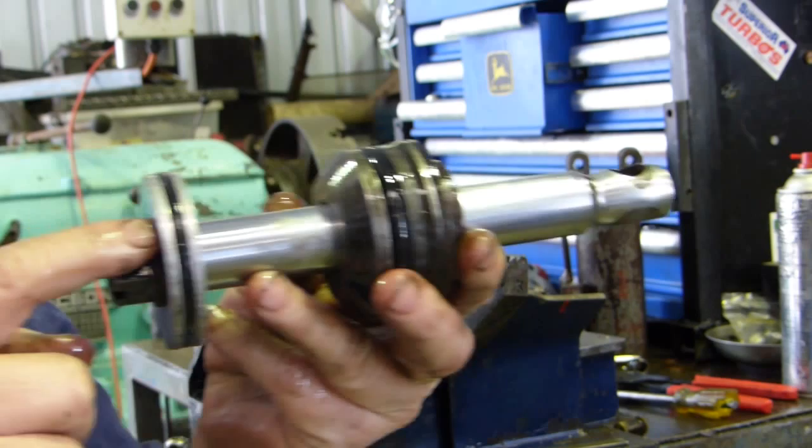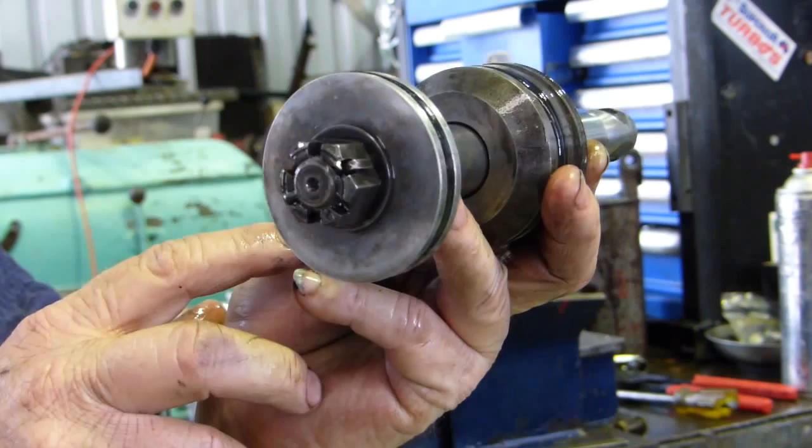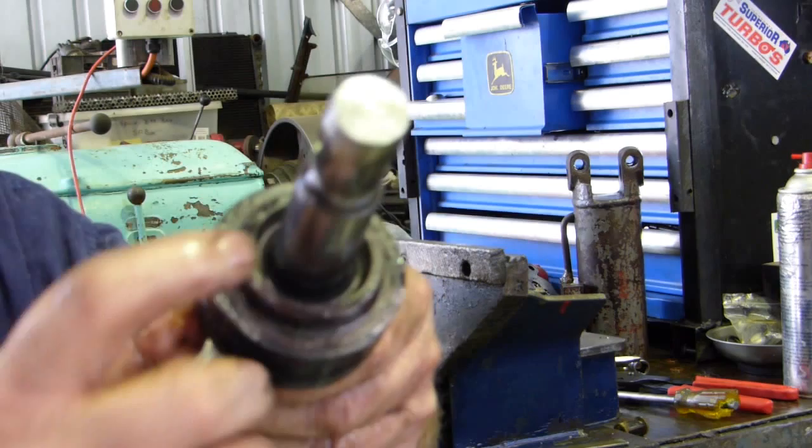This is your piston — it sits inside the cylinder. Oil pushes on one side to push it out, and oil comes on the other side to push it back in. There's an O-ring on the piston. There's a castellated nut with a split pin and a washer to hold the piston on — just check that's tight, and in this case it is. There's a little O-ring under there but it'll be fine; this main O-ring here will be replaced.